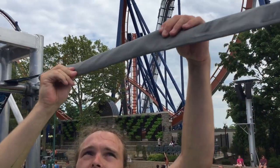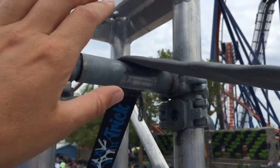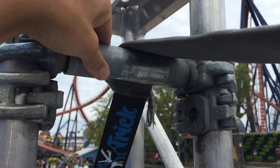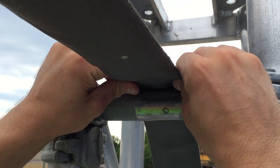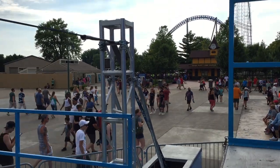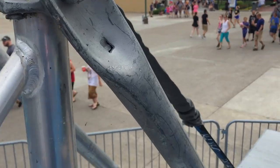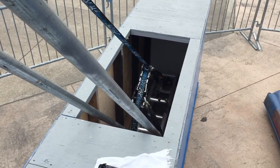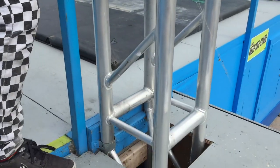So we came up with this bar — there's a metal bar in here and then a hollowed out bar on top of it that rolls back and forth. But they don't always roll, so the friction of the slack line rubbing over the bar tears it up. We put this sleeve — it's three inches, not two inches because two inches is too small — right onto that bar. We try to even it out however it needs to be and go from there. We put these support beams so this doesn't rock too much back and forth, and it's attached to the stage down here.